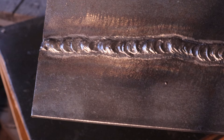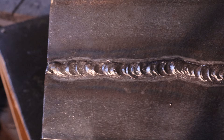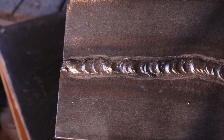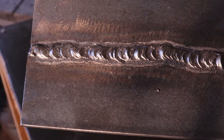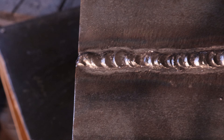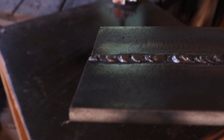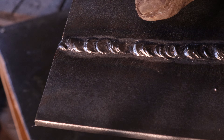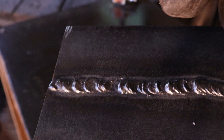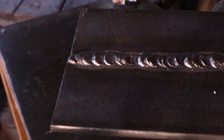You can tell by the amount of BBs on the weld with the 6011 that this is a higher deposition rate, meaning that more of the weld rod is going to end up in the metal instead of flying out into spatter or little sparks. This rod really likes to stop because it's melting so much of that base metal that the arc length changes — it's melting the metal down and increasing the length of the arc — so it really likes to change the arc length and stop the weld.